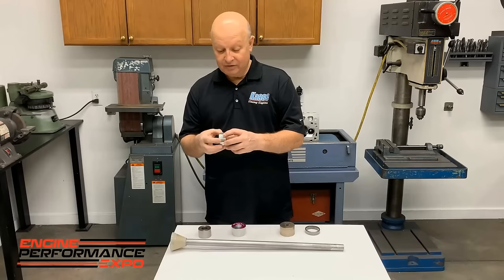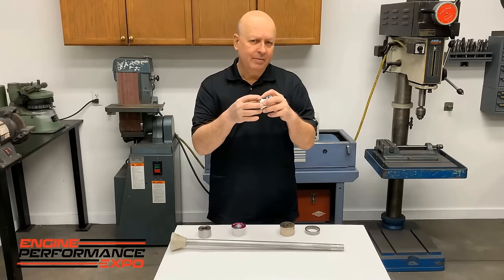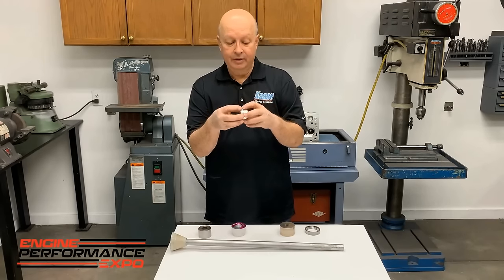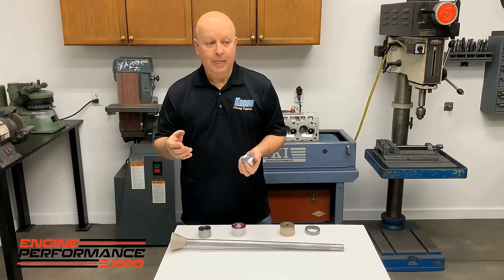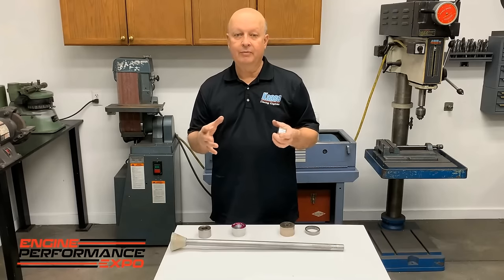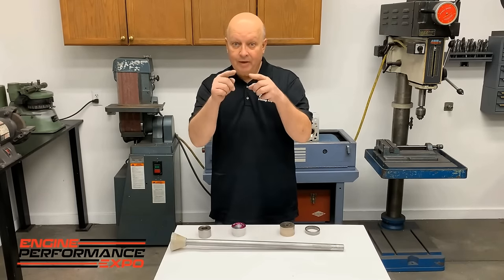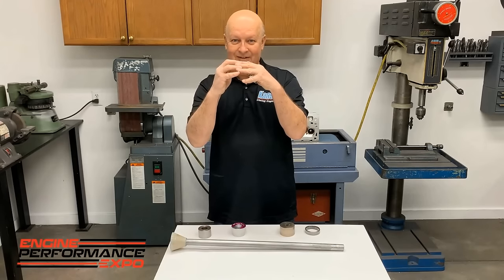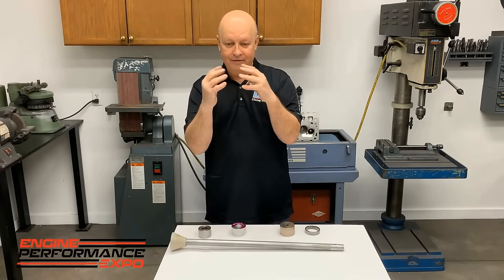You know, and usually it's toward the beginning where you knocked it in. Like the edge here took a little bit of the babbit, and it pushed it in a little bit. And we even had some Caterpillar cam bearings that we used on some 60 millimeter stuff that they were for the big race engines, and they were actually made out of a strap of metal, and they have a little zigzag in them at the top. They're not full round, and they're pretty good bearings though, but they have a zigzag in them.